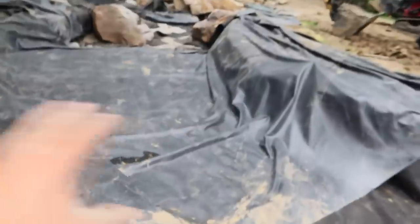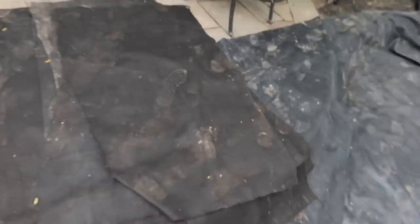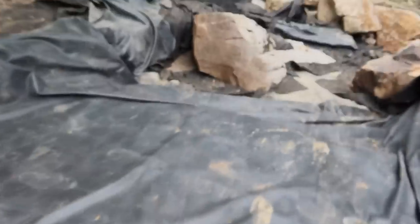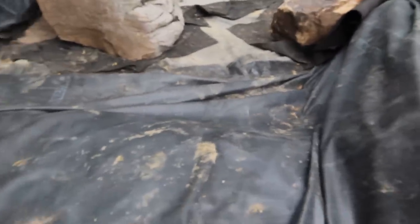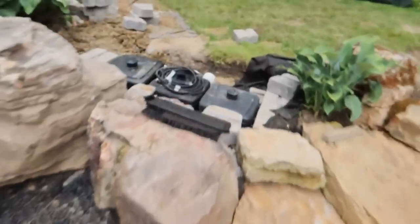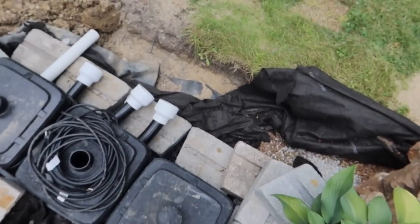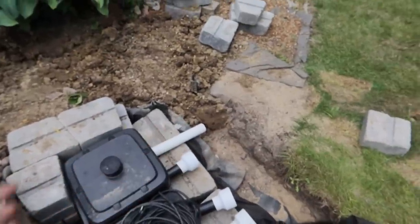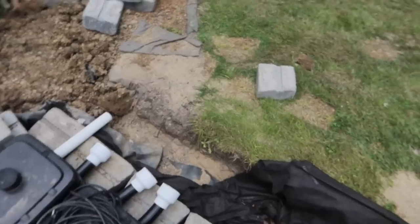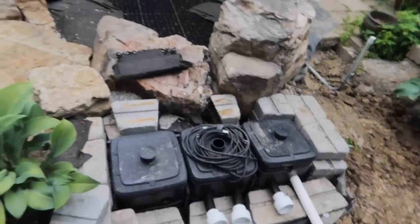We got our sheets ready to set some rock. In preparation of Brian coming back tomorrow, we're going to come through here and start slamming some rock in and getting this entire stream area done. Then come over here — we got the plumbing done. All of our plumbing down here is ran, so we have four 9PLs in here. We just got to grab another check valve and then we can finish up this pipe. We have our pipe ran for our sump pump, so we can finish cutting our bricks, lay that on top, and we're set to cover these vaults.